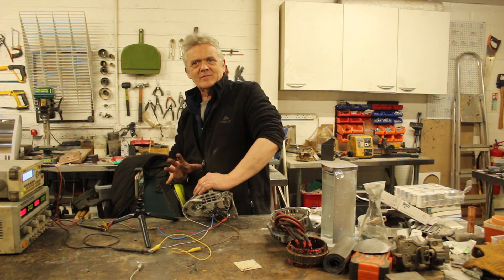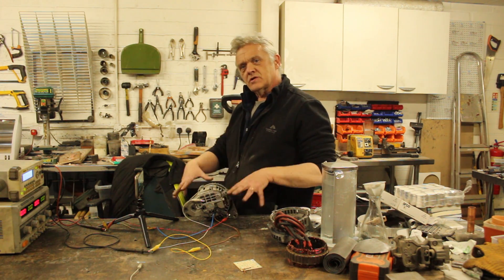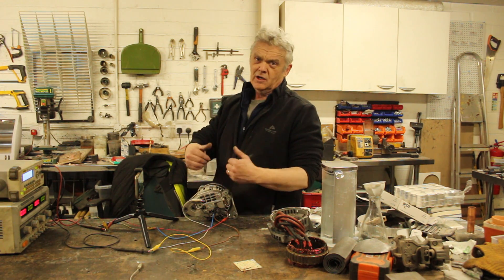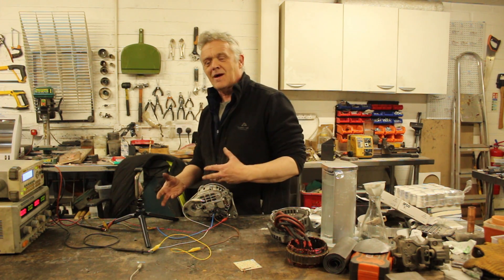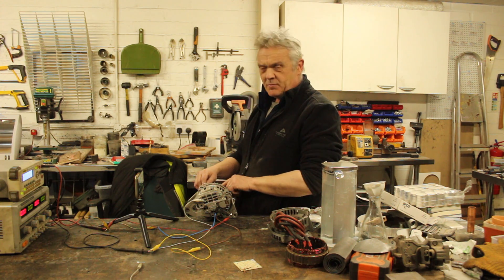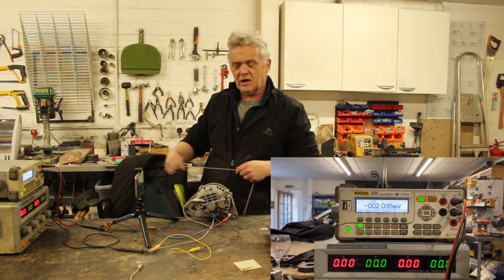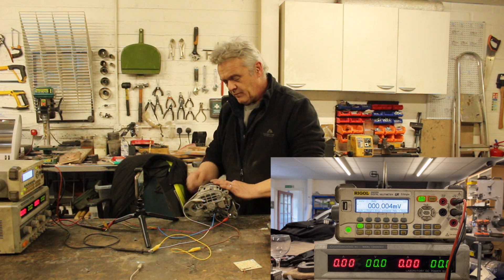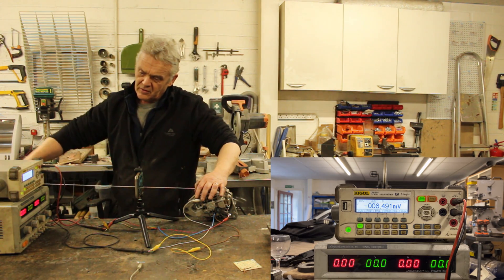The residual magnetism is really interesting. I've taken the rotor wires and connected them to the stator wires, so the residual magnetism in the rotor will make the stator generate, the stator will feed that power back into the rotor, the rotor magnet gets stronger, there's more generation, the field gets stronger — a positive feedback mechanism based on rotation speed. It needs something more permanent than spinning by hand, so I put a bit of string around it to pull and see the millivolt reading increase — it went up to about 3 millivolts versus the 1 millivolt or so by hand.